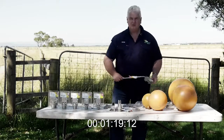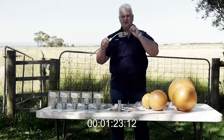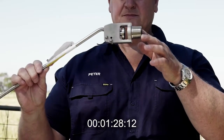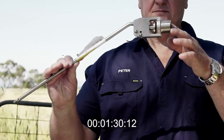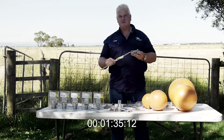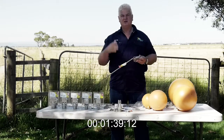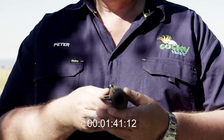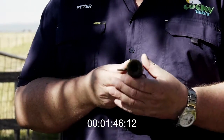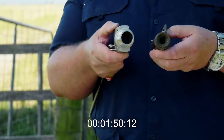The way the valve achieves full flow — this is the only valve and remains the only valve on the market that is side-discharged and has an exposed seat. The gap you can see there by the circumference is greater than the inlet area, so whatever comes down the line comes out of our valve with no restriction. If you look at the opposition valves, on the high pressure ones there's a conical reduction down to sometimes as small as 8mm, so you're not getting the flow rate. With our valve, you get a full flow valve — there is no restriction at all on our body.